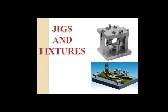The following steps are followed to clamp the workpiece by means of a bayonet clamp. Pushing the bayonet forward through the straight groove so that the clamp touches the workpiece. Turning the bayonet clockwise at the end of the straight portion, the inclined groove in the bayonet acts like a part of a thread. A 1 degree to 7 degree helix angle is provided to the inclined part. Because of this, the clamp does not get loose due to vibrations.